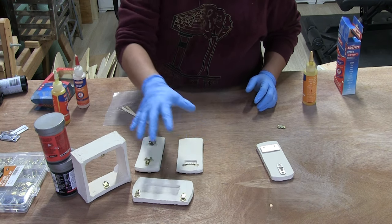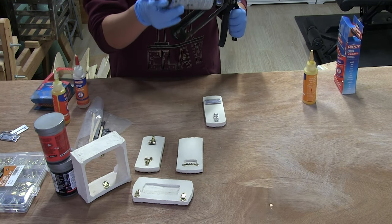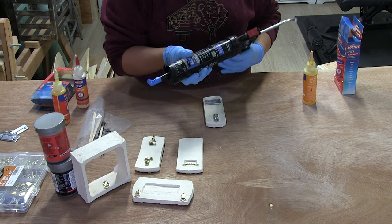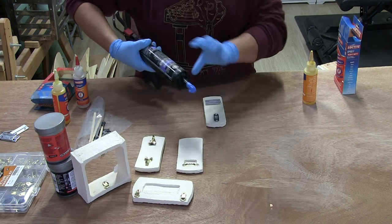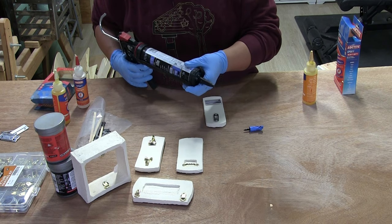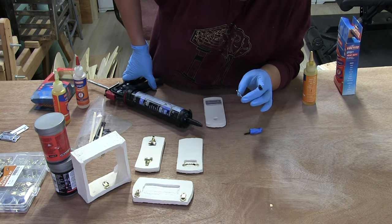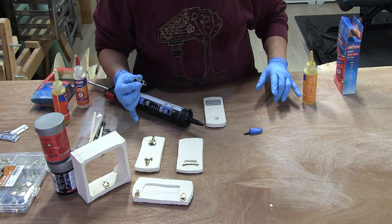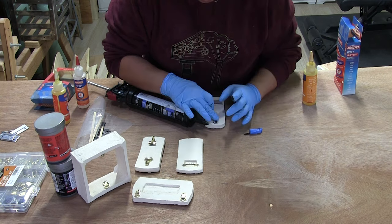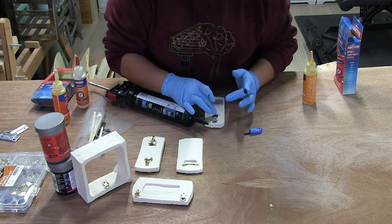I'm going to use silicone on these last two pieces. You do not need to buy a big silicone gun like this — I just am using a lot of it for another project. A lot of times you can get a small tube of silicone. Silicone is kind of a one-shot deal — you can cap it and save it but only if you're going to use it within a couple of weeks. The smaller tubes are kind of throw-away. Unlike the two-part adhesives, silicone once opened won't last indefinitely. In terms of silicone, don't buy a big tube thinking you'll eventually use it — it'll dry out before you get to it. But it is cheap and you can get clear in the small tubes.